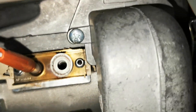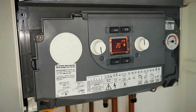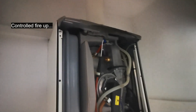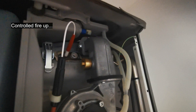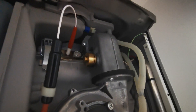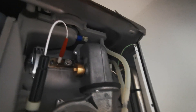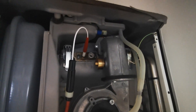It would have only got worse with winter coming — it would have been on a lot more and it probably would have spilled into the room. I'm always saying how important the mirror test is, and it really is, on sight glasses and electrode seals. Run your mirror around it. Worcester have changed their sight glass and it's no longer in their bar electrode kit for the CDI range, so always try and upgrade them when you can, because you can have a similar situation with those.